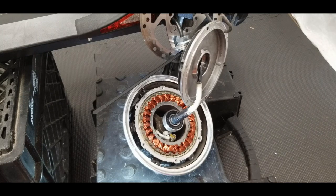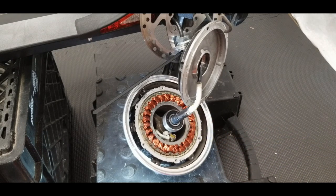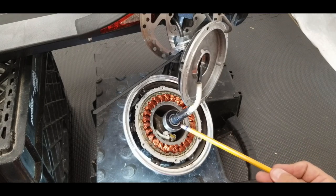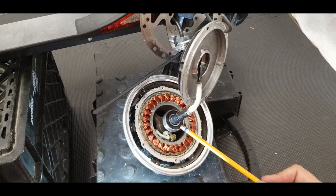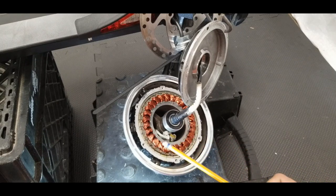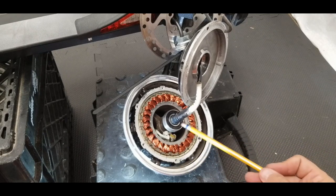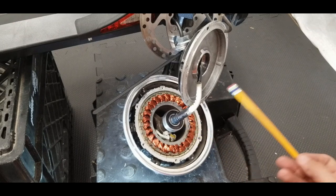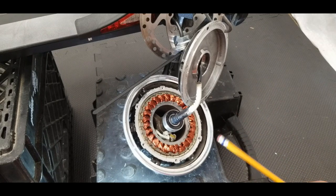Let's talk about the expense of replacing this motor. If you have some bearings going bad, these particular bearings — or even higher quality bearings — you can get off Amazon or a whole slew of different places, ranging from anywhere from $10 to $15 a piece. So if you're mechanically inclined and feel confident, you could replace the bearings and be good to go. If you have a shorted winding, you're going to have to replace the whole motor. Even if you don't feel confident replacing the bearings, you can always just order a new motor. Directly from NAM Robot on their website, this motor is about $250. Depending on how your pockets are and how mechanically inclined you are, that's the decision you have to make.